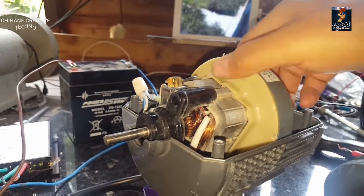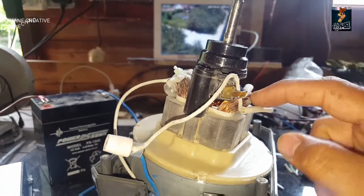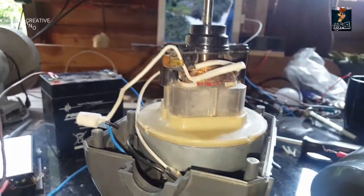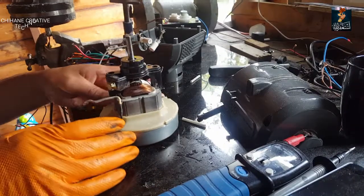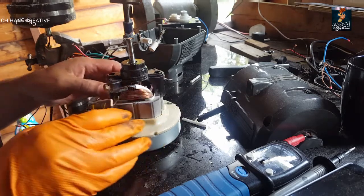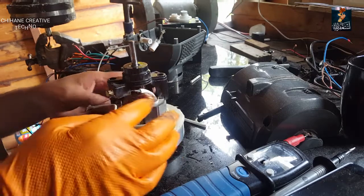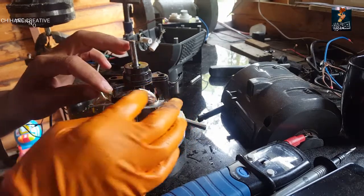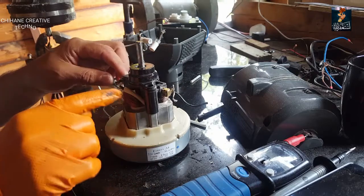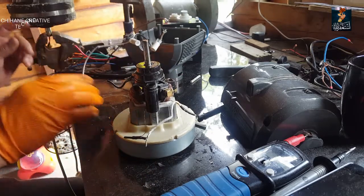So here I've got my motor — it's got two coils and two brushes, one here and one on the other side. What I've done is I've pulled the two coils in series like that, and you can see each terminal of each coil goes to one of the brushes — this one goes to this, and this one goes to this one. So now for the battery...